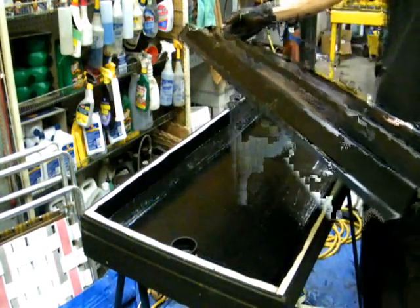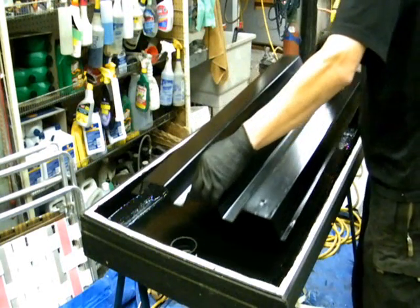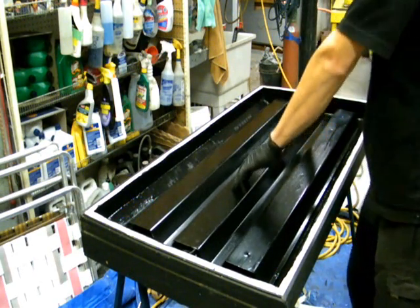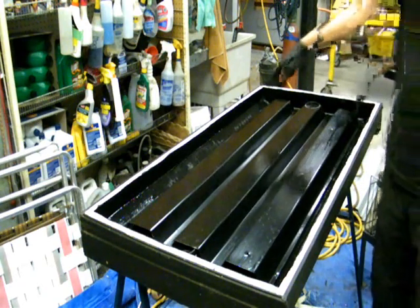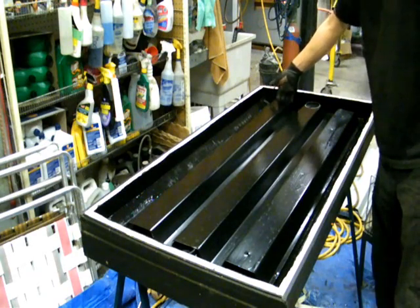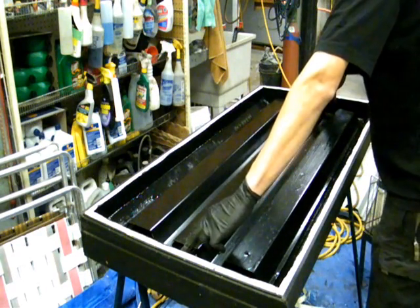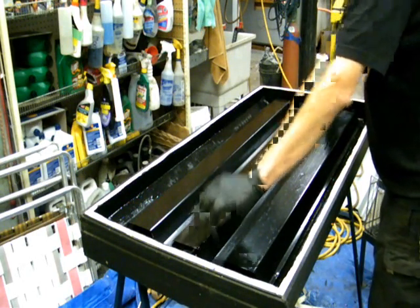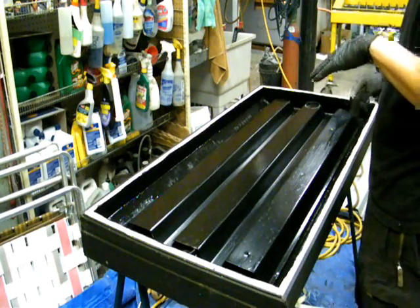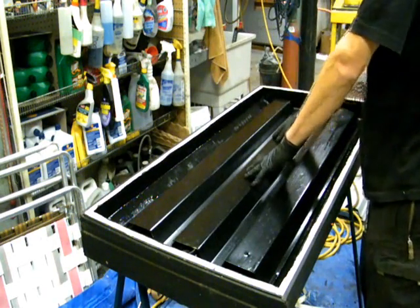Here is the painted piece of corrugated siding — the kind you would find on industrial buildings. I got these as scrap pieces they were throwing out. I'm just going to center it inside the solar hot air collector, giving it enough space at the bottom and the top. Then I'm going to put screws in to hold it in place, because there's going to be airflow in here. The air in the solar air collector is going to be going through there and up. Here are the vent holes — this is where the air is going to be coming out. The corrugated baffles will slow down the airflow, and when the sun comes up, since these are standing on their ends, the sun will hit the sides of the baffles and the front to warm it up. As it tracks across the sky it will always stay concentrated.